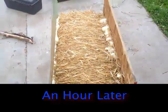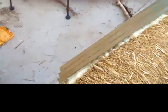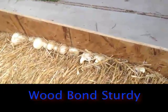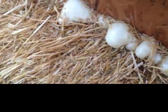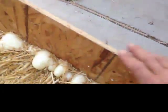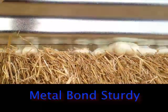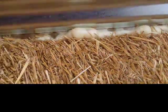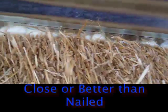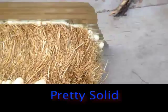It's about an hour and a half later. We've got the metal side stuck and the wood side stuck. Working with the wood first — it's pretty solid. Put a knee on it, push — it ain't going nowhere. It's very stable. The metal side is pretty similar. I try to push it off and you can see the foam bending, and the bond between the foam and the straw is pretty good. So I'll see what the structural engineer says, but for my immediate survey, this looks like a pretty viable way to build a roof.